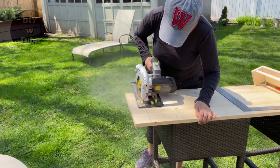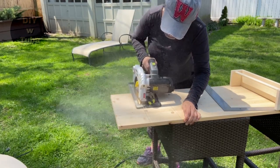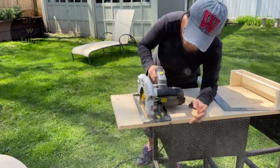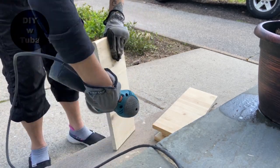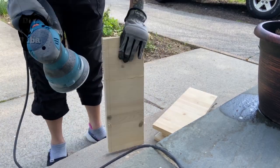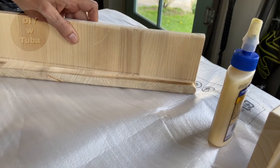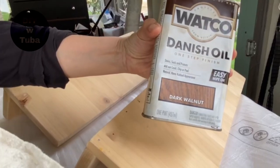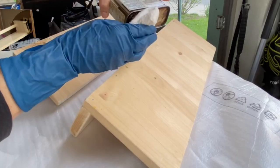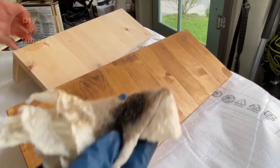Now it's time to work on the shelves and the spice rack. I am cutting a couple of shelves and I am going to use the rest as a backing for my spice rack. I found this wood in the garage, so I didn't pay anything. I am going to sand the edges — it is a nice wood, not plywood. I use regular wood glue for the shelves, glue them together, clamp them, and put some nails with my nail gun. So I am going to stain them with Watco Danish Oil in dark walnut. I know these shelves are too basic, but I am not a carpenter, so don't judge me for my skills.